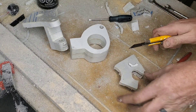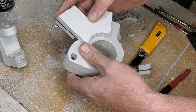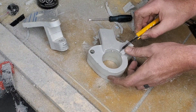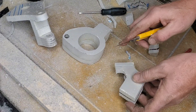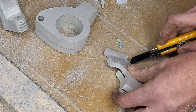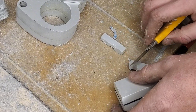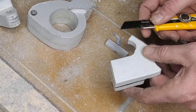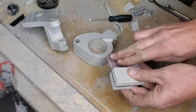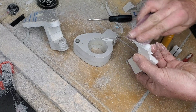What I'm working on right now is the tensioner for the whole pulley system. It was an oversight — I didn't realize I was going to have to tension this pulley. I thought gravity was going to do the job, but then I started thinking about torque and physics and realized it wasn't going to work as expected. It's a good thing I built this in foam first. You can work it with regular hand tools — sandpaper is more effective than you'd expect. I'm cutting a chamfer off the corner here, and you can use the belt sander and 100-grit sandpaper to carve nice radiuses. I will warn you though, if you have any sensory issues with sounds like fingernails on a chalkboard, you'll want good hearing protection.